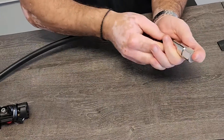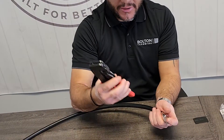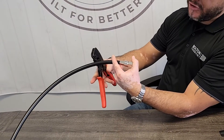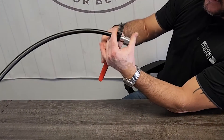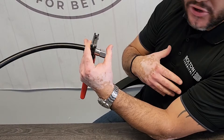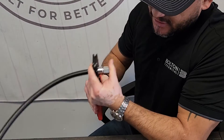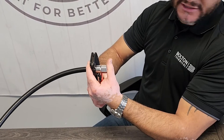The last step is to terminate the sleeve. I'll take my LMR 600 crimper — this is the crimper that is going to crimp the LMR 600 to be sealed and ready for use. I'm going to apply the crimper over the cable, slide it all the way up, and get a snug fit. I want to apply pressure on the connector so it won't slip off as I'm crimping. Everything is fitting good and snug, so I'm going to apply pressure — give it good firm pressure — and you're going to get a good clamp on that center conductor and connector, and it's ready crimped.